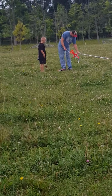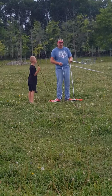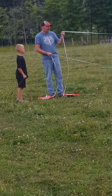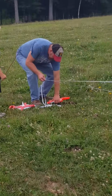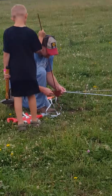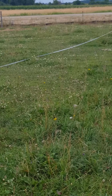So I got my 80 feet and my 100 feet on my tape measures here. Make sure your tapes are straight. Pull them up in the air a little bit. Give them a little jolt so that way when they snap back down they're straight. A little bit of tension on them. And where the 80 foot and the 100 foot meet, that is where you need to put your post. The camera person will walk over here so they can see the tape measurements.